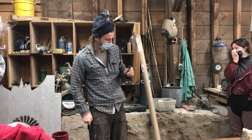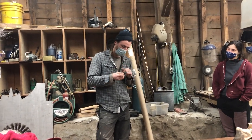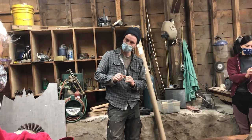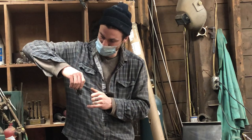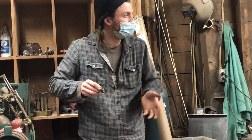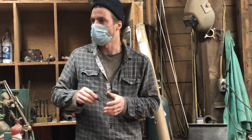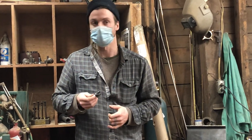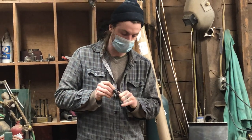But if you Sharpie the edges, you're going to be able to see what you're removing in terms of material. When you think about a bung cutter, this bottom point right here is really the cutting edge. You have this side that's cutting the long grain, and then this sharp point right here that's cutting across the grain, kind of like the knickers on a rabbet plane or the teeth on a crosscut saw. So you've got that combination of two cutting edges that's really going to make that cut happen well. So when you're sharpening these, you want to be sharpening this face and this face.